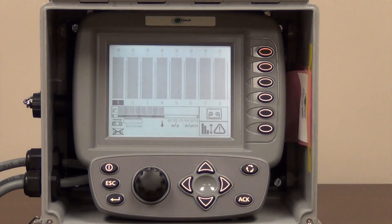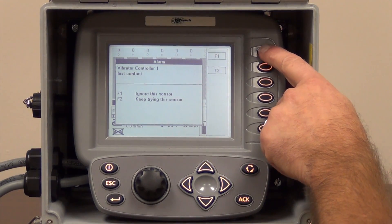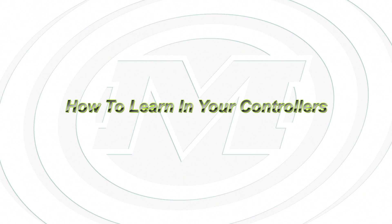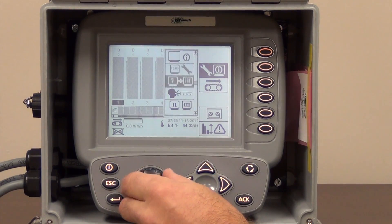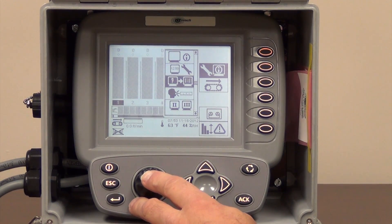This is the version of software at the bottom — 4.13. When we turn the monitor back on, you are going to get alarms, and that is fine because we have not learned in the controllers yet. To silence the alarm, we are just going to press F1. Now we need to learn in the controllers for this system for the vibrators to communicate to the controller back to the monitor to show us our vibrator speeds. So again, we are going to push the second button down on the right hand side twice and open up the box with the question mark 0101 — this is where you learn in the controllers. Open that up.